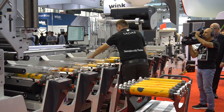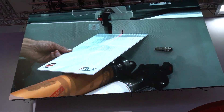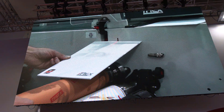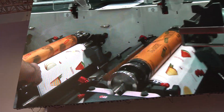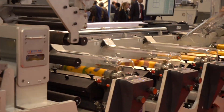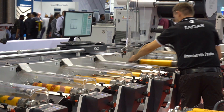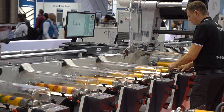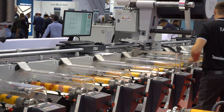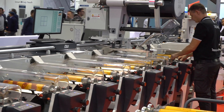On this next unit, we're going to ask Tadas to show us the laser beam on a white board so you can see it clearly. It makes it very easy to line up with the notch of the cylinder. This is the first laser application on a flexo printing press — and if you find others, they're just copy-paste. iLight is standard on all iFlex presses. All he has to do is repeat that simple operation on every printing unit, and the pre-registration is done.